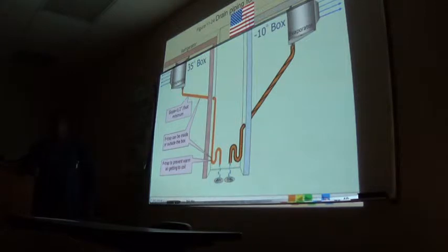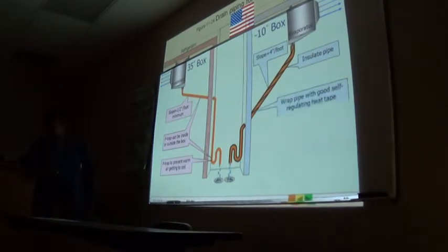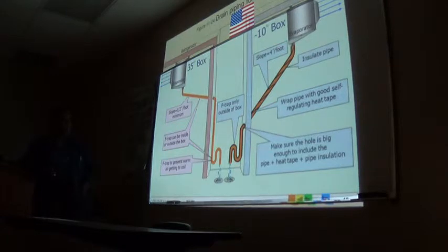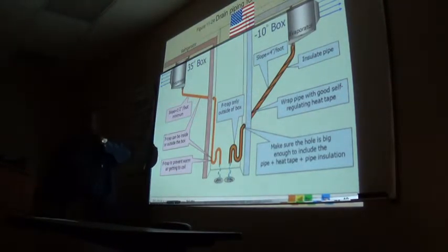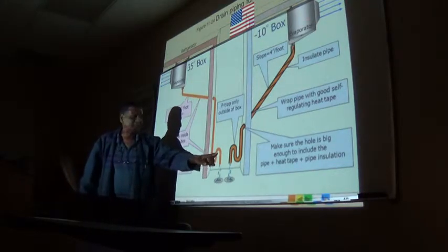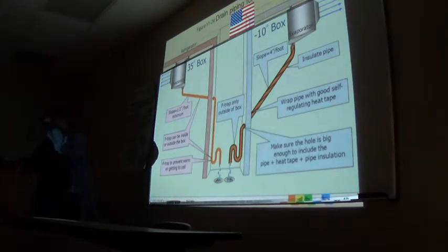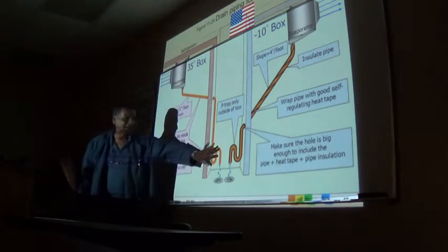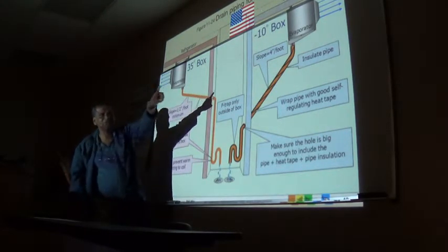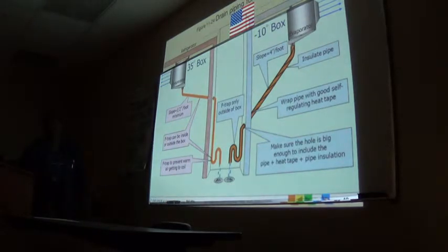See the 4 inch per foot here for this one. Deeper slope. So in this case, you see the P-trap can be inside or outside of the box, it doesn't matter. Sometimes I have no space here because this may be in a place where they push stuff in the corner of a wall, you know, they like to stick boxes and what have you, or the cart, and you know they can put something and break this. I would just put this direct into here and put one of those S-traps I showed you yesterday, the run-in, and I put that here and make this a little bit more heavy. Okay? Alright?